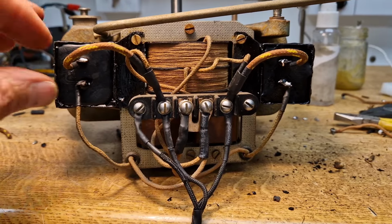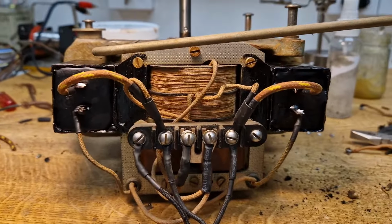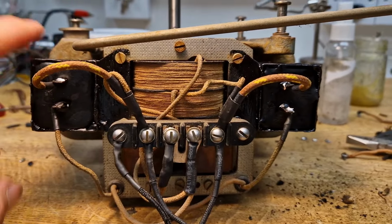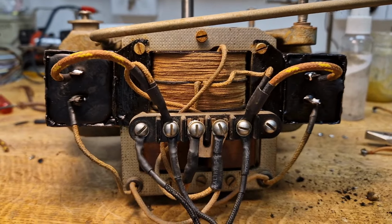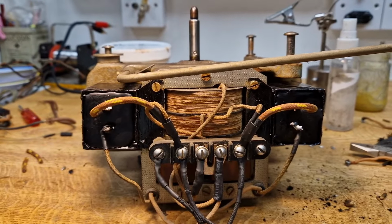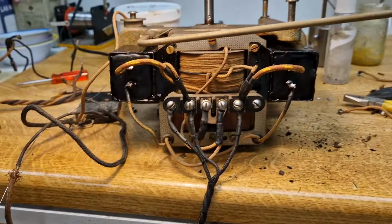Alrighty, so the motor is rewired. I say rewired, cleaned up, tidied up. These wires have been replaced, you can see, with some period looking wires, and a new mains lead that goes in here in period looking cotton covered flex. The two microfarad capacitors, one here and one here, have had the pitch taken out, old capacitors taken out, new ones fitted, and then refilled with pitch so they look as close to the original as possible. So just going to get this back in, well, after quick testing, but it should be fine. Then I'll get it back onto the baseboard because I've got to wire up the mains that goes to this funny little socket thing we've got, which is this. So I've got to fit that back to that, and then we can get it back in the Gram and actually test the motor part.